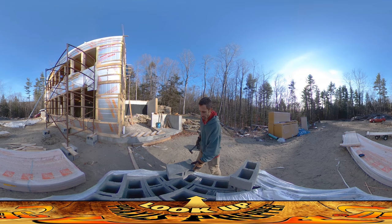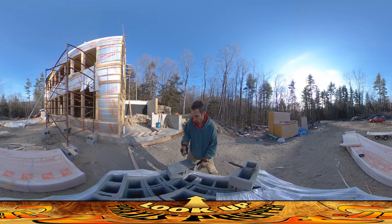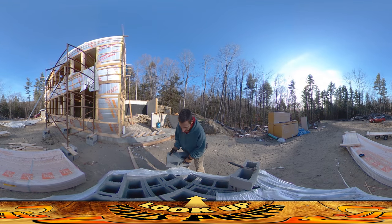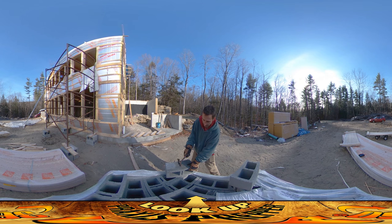The way that you do that — one way at least — is I usually just take a hammer and tap along the line to start getting cracks going through there. If you do this enough times, you can usually tell from the tone — you hear the tone it makes — you can usually tell when it's kind of given through and it's broken. Do one side, quick light taps, not big hits. You don't want to smash the brick, you just want to start fracturing little fractures.